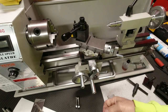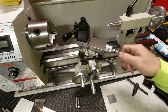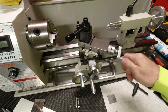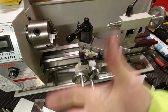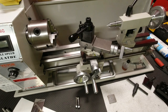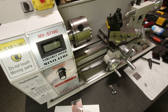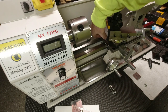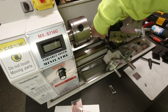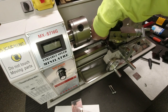I'm still debating whether to cut something in real time, because the camera is usually right in the middle of everything which makes it challenging. I did try and failed. I moved the camera back — right here was a drilled and tapped hole, but it wasn't all the way through. I couldn't put this 6mm hex bolt all the way through, so I took a tap and tapped it to thread all the way through.